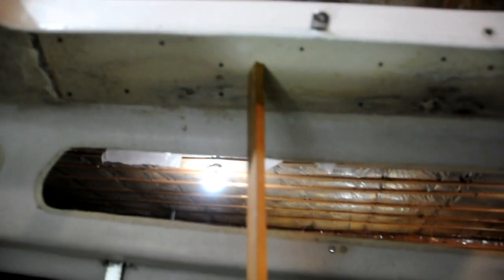Well, I'm down to the last kind of structural repairs. I just pushed the skin back up underneath the deck on this side. There's a few really short screws that just go partway through the core that are clamping it up into place. And I'm just about to do the other side now. The wood's all up there in place, and it's just been coated with a nice thickened epoxy with 404 and 410 filler. And so I'm just about to put the mixture on the underside of the skin, and then I'll put that back up in place.